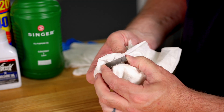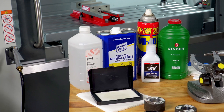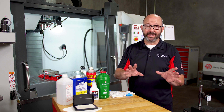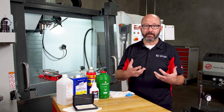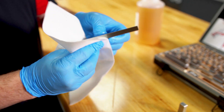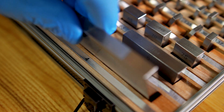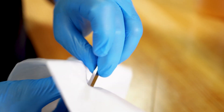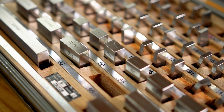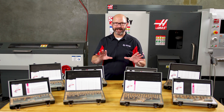If dirty, we can clean them with rubbing alcohol or mineral spirits. It's always a good idea to wear gloves of some sort when handling expensive gauge blocks, but I don't often wear them — I'm just too busy measuring parts. I do take very good care of my gauge blocks, and every time I'm done using them, I wipe them down, cover them with a light oil, wipe that oil off, and place them back in their protective boxes after each use. While we need to respect our gauge blocks, they're not fragile. They've been hardened to 63 Rockwell or better, so you're not going to wear them out by cleaning them.